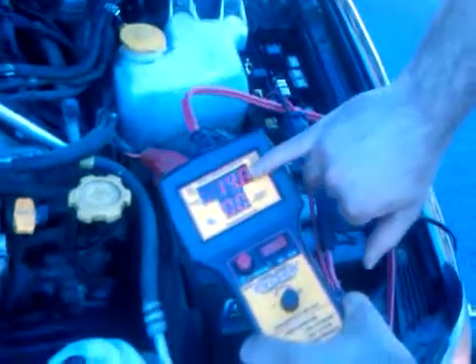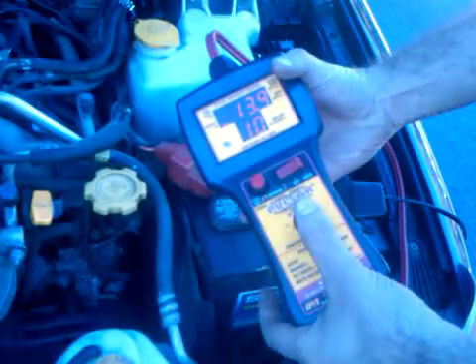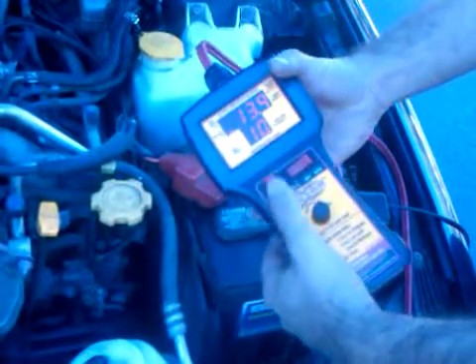So here the Pulsar is going to show you what the circuit's actually seeing in voltage. I'm going to set it up to about 10 amps, because I know an air compressor really shouldn't draw more than 10 amps, so I'm going to lock in the tool. I have it in manual mode, so every time I push this button, it's going to power it up.